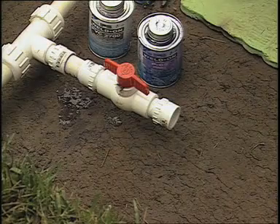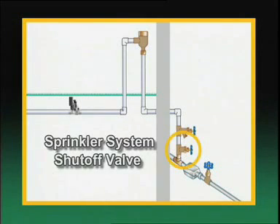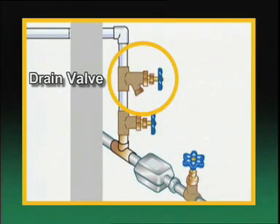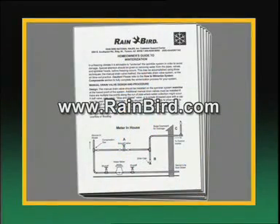For those who live in a colder climate, you'll also need the ability to winterize your system. In these areas, after turning off the sprinkler system's supply, any water left standing in the pipes could freeze, causing serious damage. So it's important to install some additional fittings that provide a way to evacuate any remaining water in the system. For further details, refer to the winterization section at www.rainbird.com.